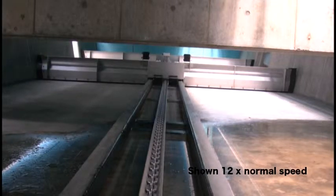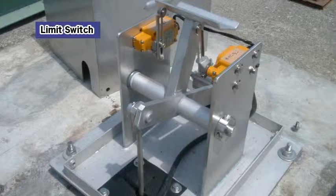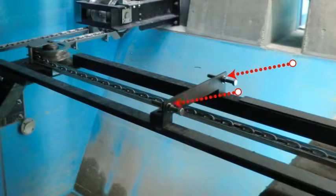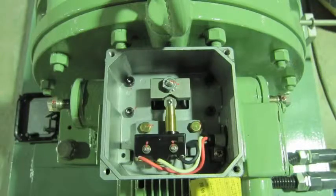This sequence of action is repeated. The system is equipped with numerous protective measures. In the event of a malfunction of the stop limit switch, an overrun limit switch will automatically stop the drive if the stop position is surpassed. If all limit switches are out of order, the stopper built into the rail will stop the blade carrier, and the torque limiter built into the speed reducer will stop the motor. If the stop switch is inactivated after a given time, the motor is stopped automatically to protect the system.